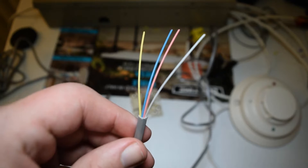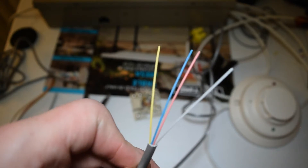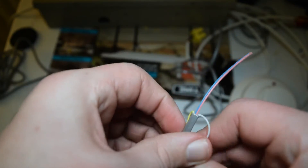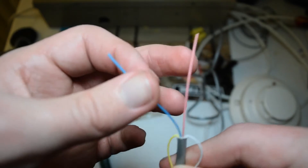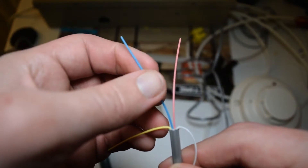Now that we have the wires exposed, we just need to use one single telephone line pair. A telephone wire like this typically comes with two pairs, which is two lines. A pair is just two out of these four wires, also referred to as a tip and ring pair. With this telephone wire, a tip and ring pair would be the red and blue wire — blue would be the tip, and red would be the ring. It's a little difficult to explain all the different colors for tip and ring; I'd recommend looking something up online to reference.